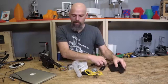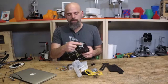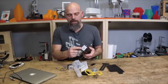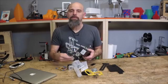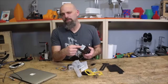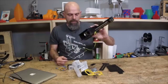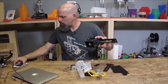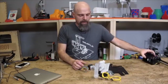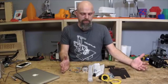The plate on the bottom holds the syringe at its base. Those right now are plastites — we'll see how well that holds up on a 3D printed part, but it should be fine if you're using something fairly viscous. I don't know that this would extrude clay unless it's really watered down. So these are all of the parts right here that you'll get to make your 3D printed bare-bones paste extruder kit.